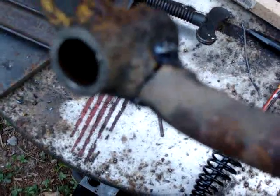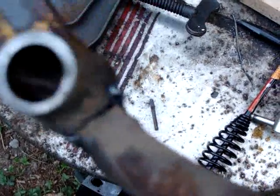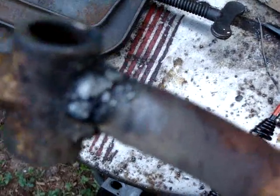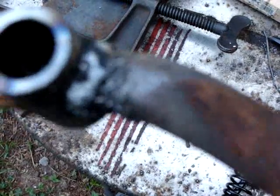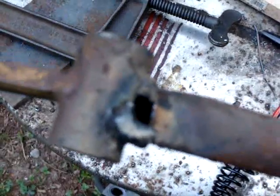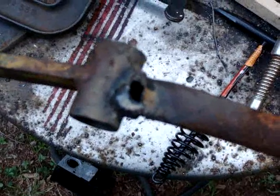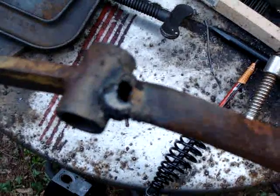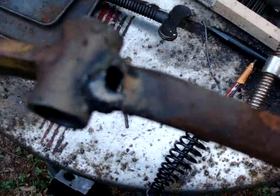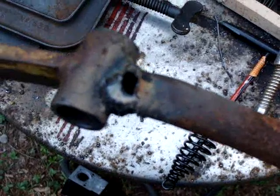And then I'm thinking now I'll come back and try and weld this whole other side. And then if I can get a decent weld there, then I can come back and grind off this mess and maybe touch it up or go over it with another bead. And then I just gotta figure out how I'm gonna deal with this big giant hole I blew into the thing. So, I don't know. If you got suggestions for that, I'm wondering if I stuff steel wool in that hole, would that be enough of a backing to let me try and run a bead over it?